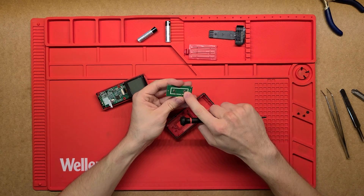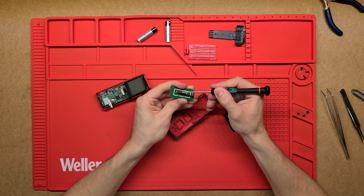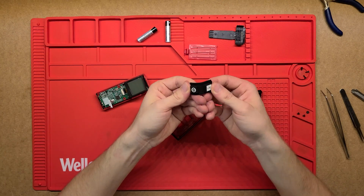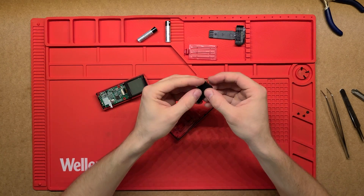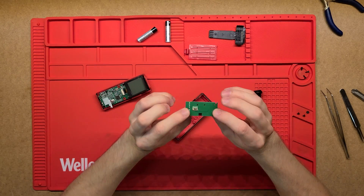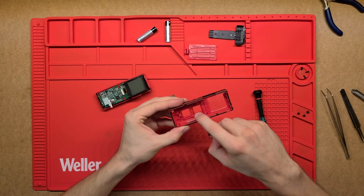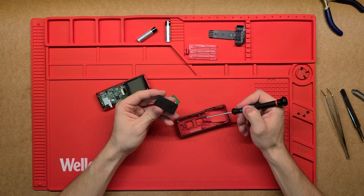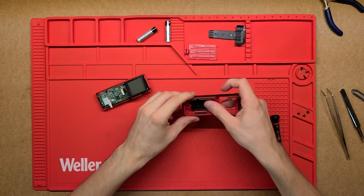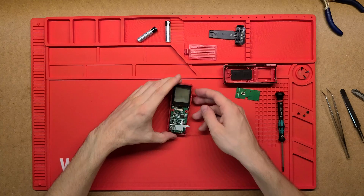The button on the PCB is just an exposed contact with a little dome-shaped piece of metal placed on top — as you push it down you get that nice click, which shorts the two little tracks together underneath. Then there's injection-molded rubber with a little dot in the center, so as it sits on here it gets pressed and actuates those two buttons. There are also two little channels inside that come up against the rubber, which under enough pressure provides quite a nice seal.